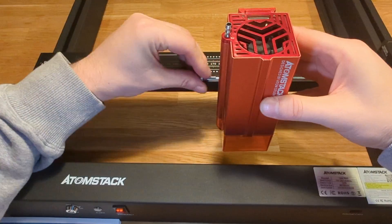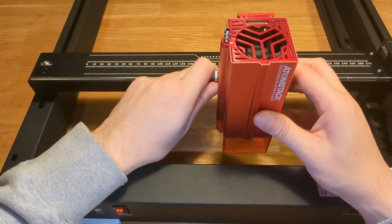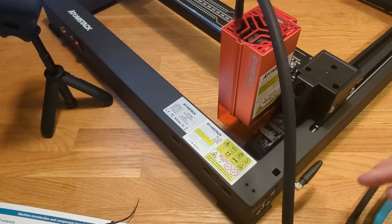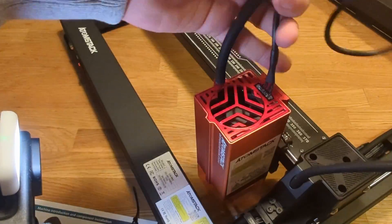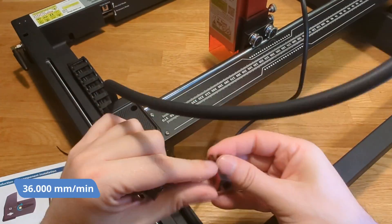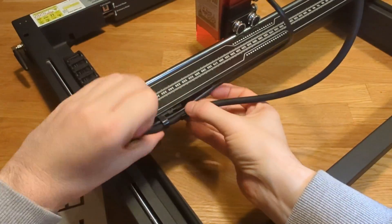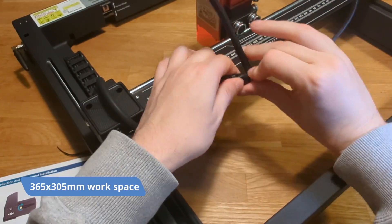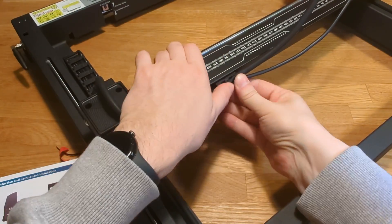The laser is made out of one single piece of metal frame — it is very stable. It has a very low profile, which is both a plus and a negative, and we'll talk about that later. Engraving speeds can go up to 36,000 mm per minute, which translates to 600 mm per second. The work area — the size of material you can fit — is 365 mm by 305 mm. By no means the biggest laser I've tested, but really enough for most home users.